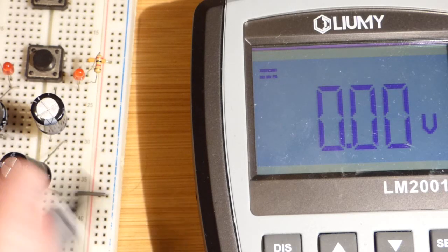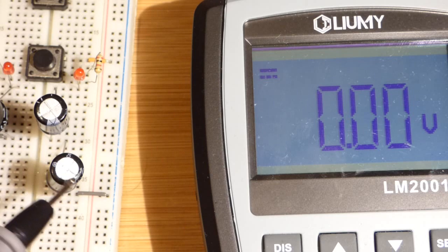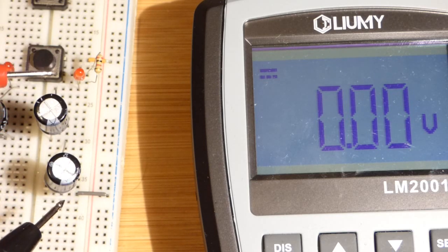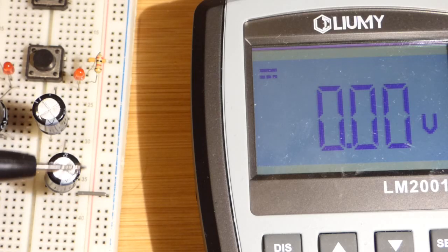That's why you can use higher voltages when they're in series. As long as we keep these balanced so they charge evenly — and these are rated at 25 volts — we could charge the two of them in series up to 50 volts. But as we saw earlier, it's going to charge quicker because it's not storing as much charge; the capacitance actually goes in half when they're in series. The advantage of being able to store more voltage is what is usually desired in those circuits.